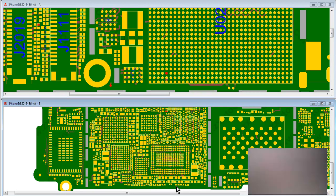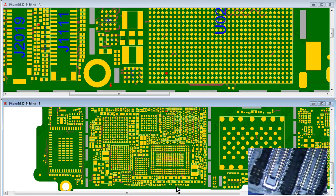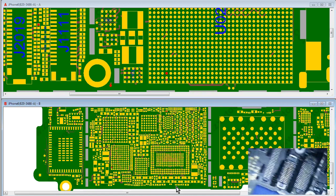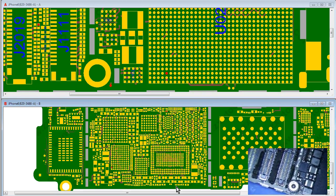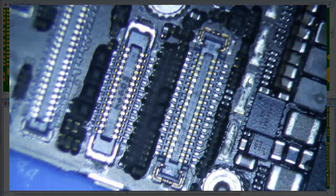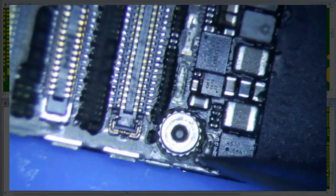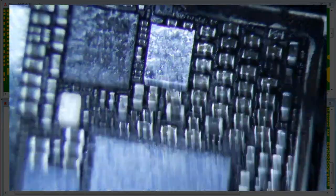I've already gotten the data off this thing, so I think I'm going to call it a day. But just for trial and error — if pushing down on this doesn't work, which does work temporarily sometimes — maybe the solution is to run it from this test point, since there's definitely continuity from here to here, and run it from here to under the chip.